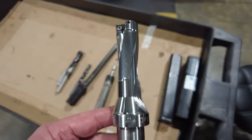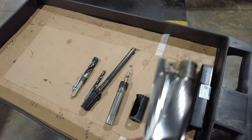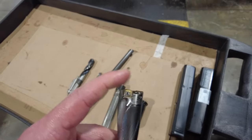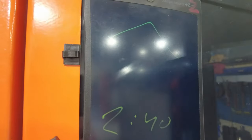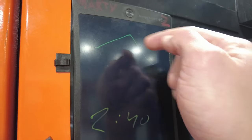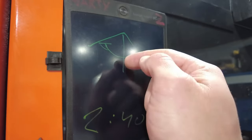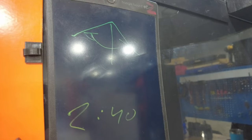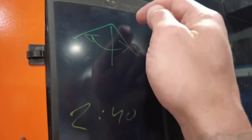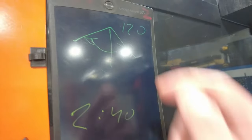This is an indexable drill, or you can call it an insert drill, because you actually mount inserts on both sides. These are 180-degree angle. You also have drills like this — these technically have a 60-degree pitch. If you're going to measure the angle between here and here, you're going to see 60 degrees, or 120 from side to side. Then we have speed drills — so regular straight drills are 120, and speed drills are 130.